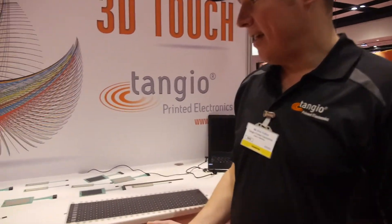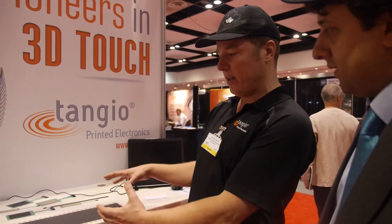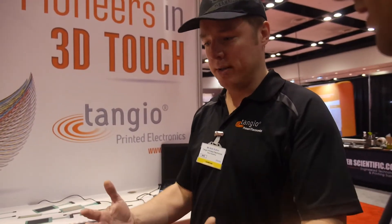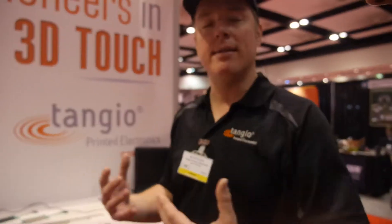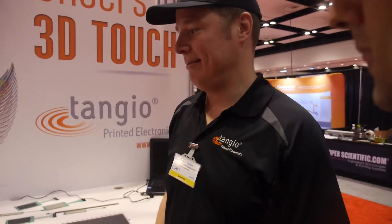How are these different from conventional force sensors? What can you do with these you can't do with other types? The force sensors we make are more temperature stable, low drift, so part-to-part repeatability, and different ranges as well. Rather than simply just detecting touch, you can build this differently — for example, you could have a car drive over top of it and still have some threshold change or sensing of different weights. There are tons of different applications and you can do a lot with it.